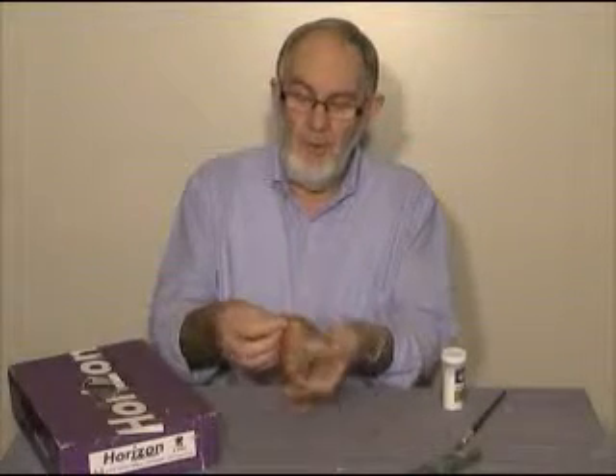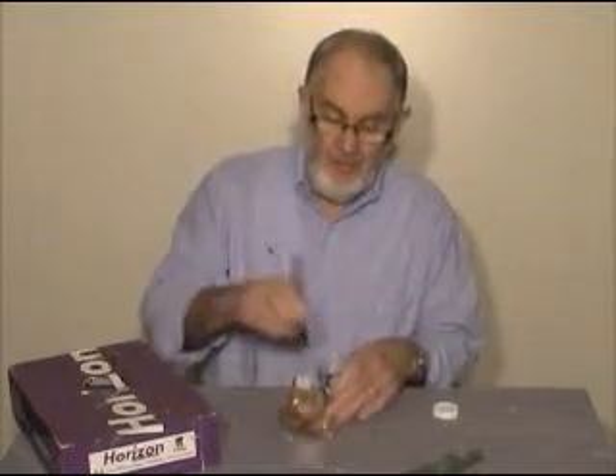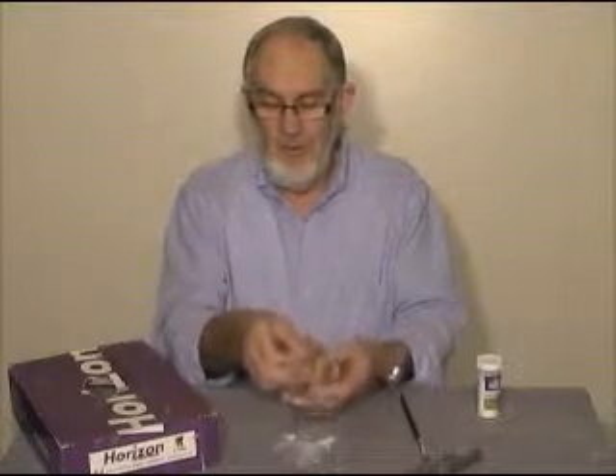Here we have it coming out of the box. Now the process — just breaking away the edges. Once we get the flange separated from the casting, we then very carefully just fold the mold inside out. I'll put a little bit more talc powder because the mold is still a little bit sticky, and this stops it sticking to itself.